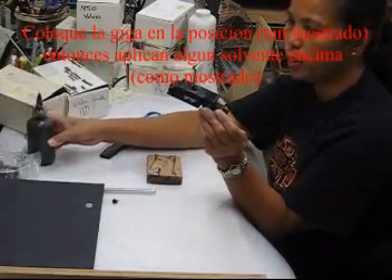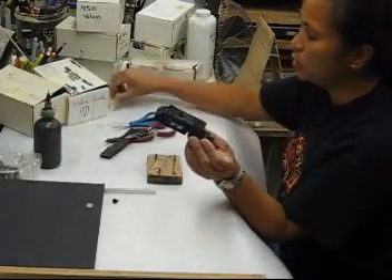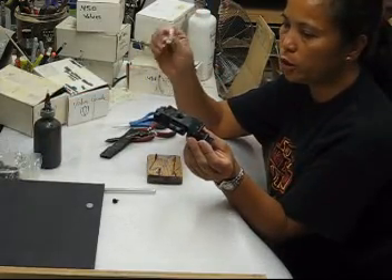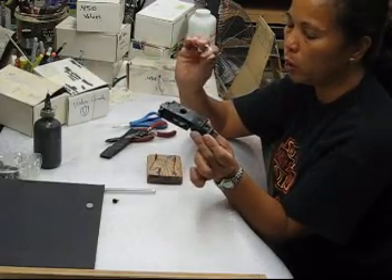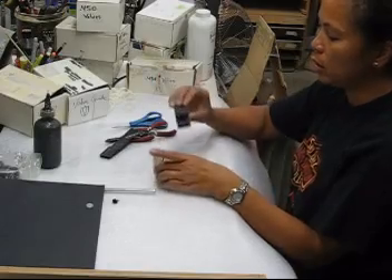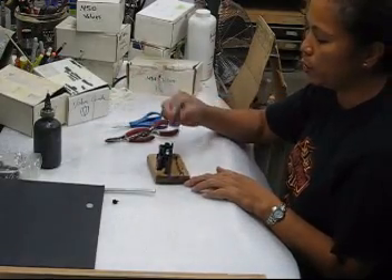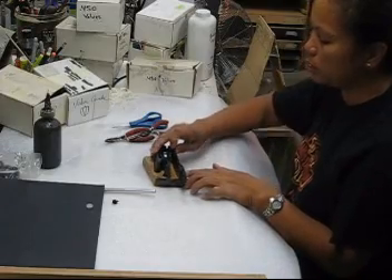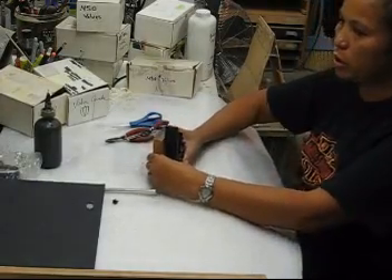You put a drop of super glue. When you put the retainer, make sure you don't stick the diaphragm — it will create a hole if you do. When you're done, you put this here on the bottom — this we call the bottom part of the pneumatic. You stand it up.